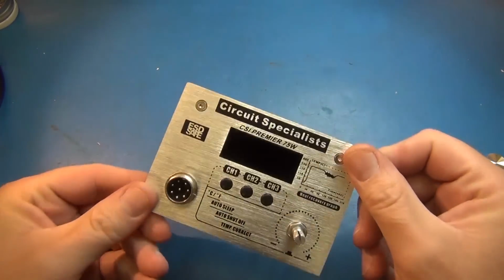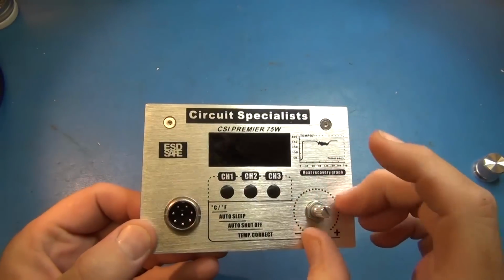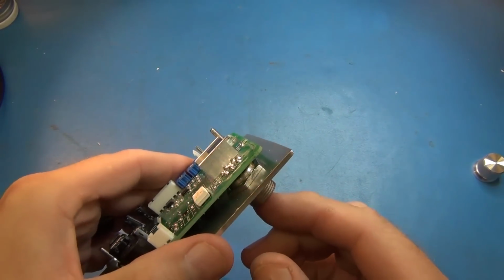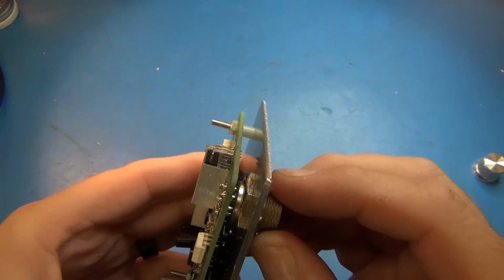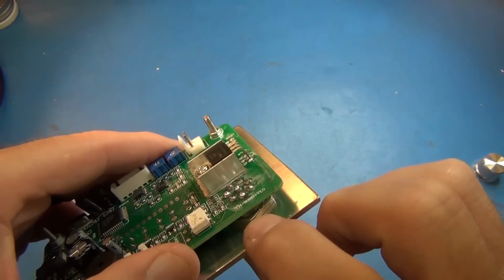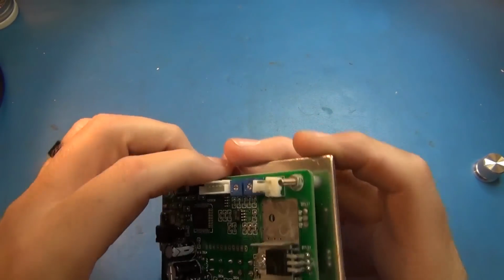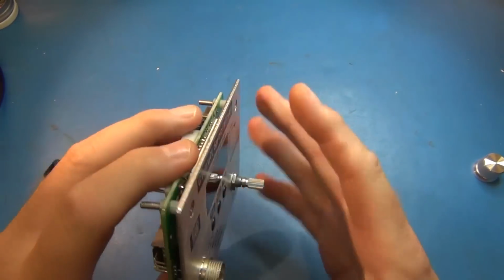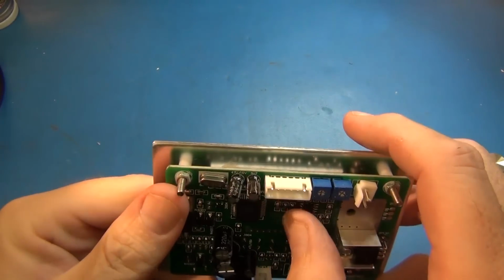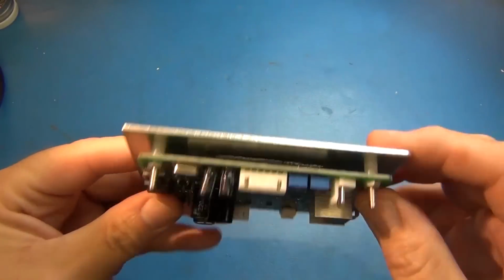So I can see I kind of want to get this board off of this face plate, and there'll be 2 screws here. There'll be this retaining nut for the collar on the rotary encoder. Unfortunately, in this particular model, this iron pencil wand goes onto here, and that's soldered into that, and it's got a retaining nut on the back. So that means I'm going to have to unsolder this, and then we want to get the board off completely for 2 reasons. We want to fully be able to evaluate what we're looking at, and the second thing is I can see already that there's a sandwich of the display through here, and there's this cover glass. I'm really curious, if I take off that cover glass, would I have a better display?